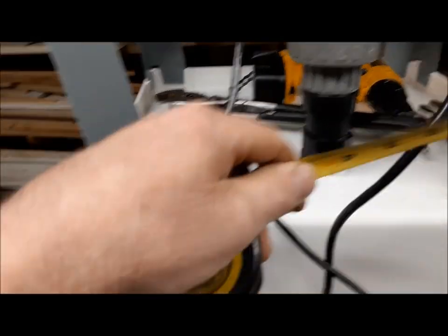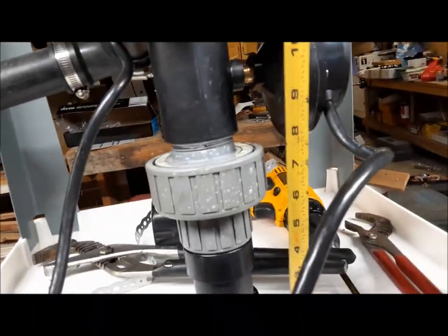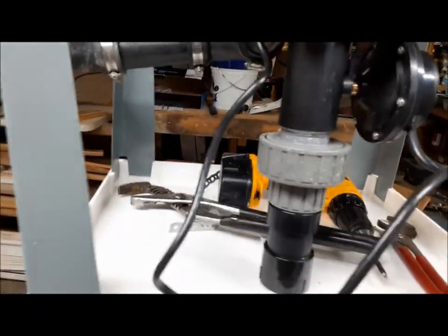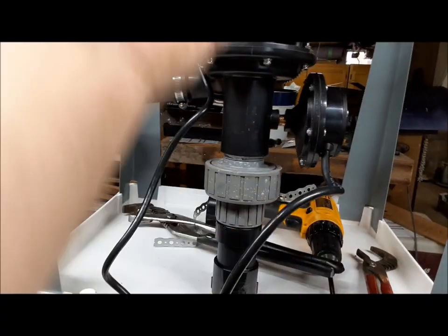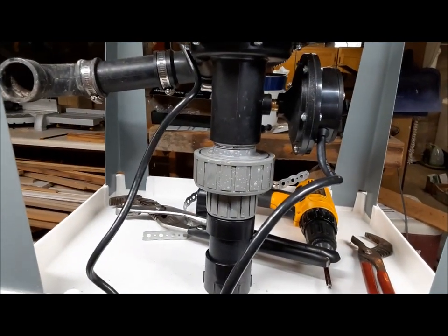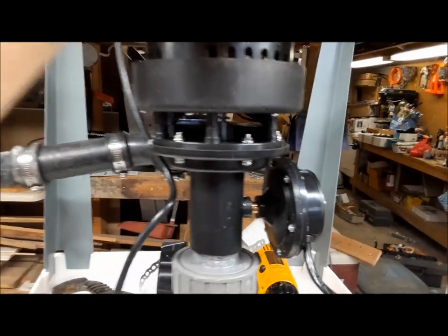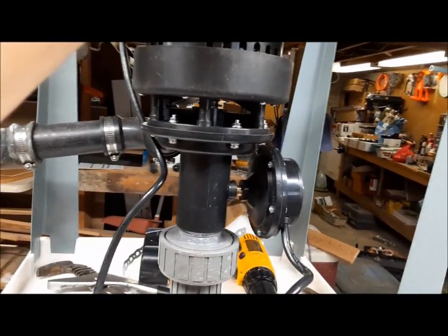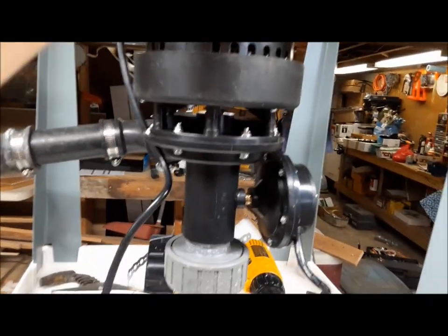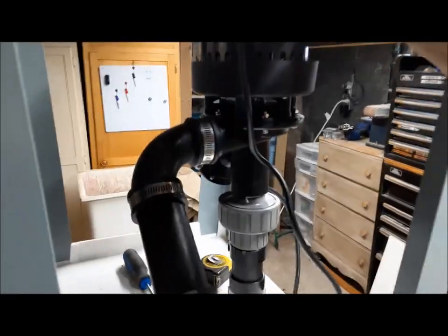It is very sensitive — I can make the pump kick on just by shoving some air down it, doesn't take much to activate it. So what I've done is made up a little gizmo out of a couple of ABS fittings to lower the pump about three inches and see if that helps. Right now I've got to fill the sink up to about here before the pump kicks on. I put my little spacer in there and now instead of five inches to the center of the diaphragm we've got about nine and a half — so we added four and a half inches of drop or weight on the diaphragm. I have to drill two new holes to put our brace back on. That's solid as a rock — I don't want it any closer to the floor.